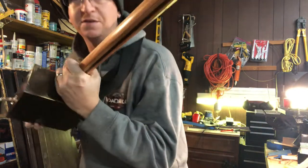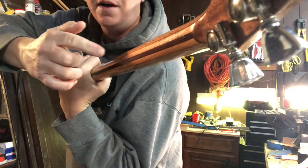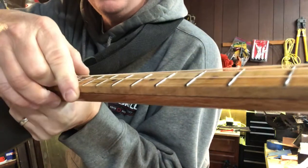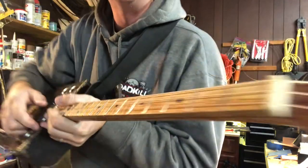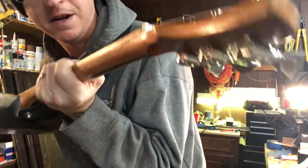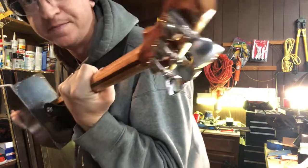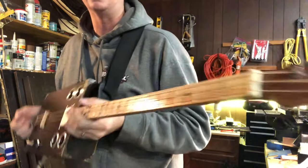The neck, if you look closely, is a five-layer neck — it's got oak, maple, and walnut, with strips of walnut veneer in between the lighter oak and maple just to give it contrast and visual appeal. It has a flamed maple fretboard with a little veneer of walnut in there as well. The headstock has a scarf joint — it's an oak headstock with a super thin walnut and mahogany veneer on both front and back — and it's got Grover tuners, which are actually old Gibson stock.